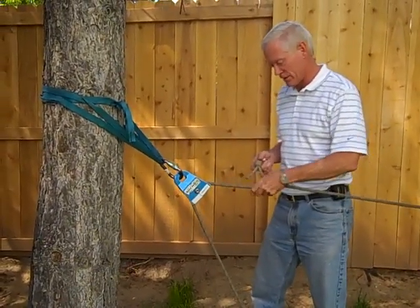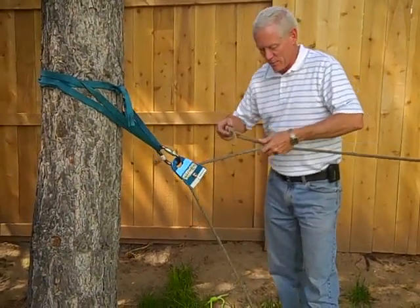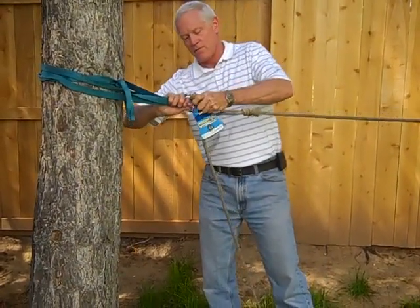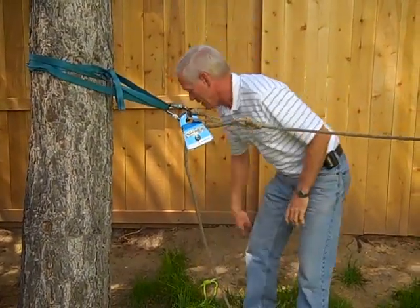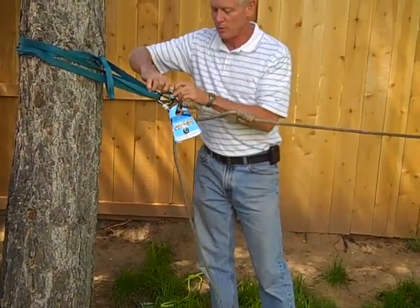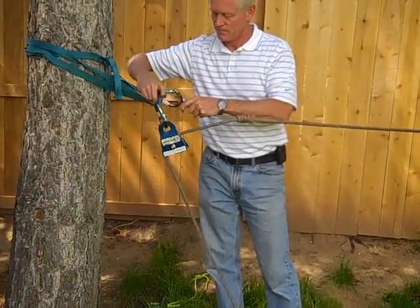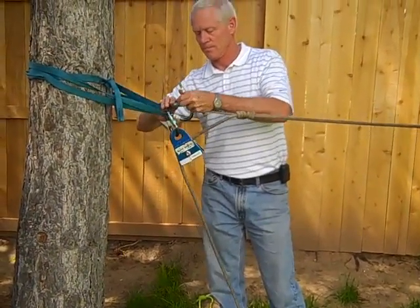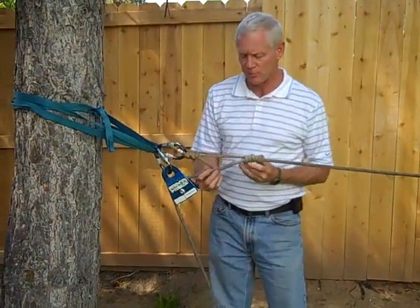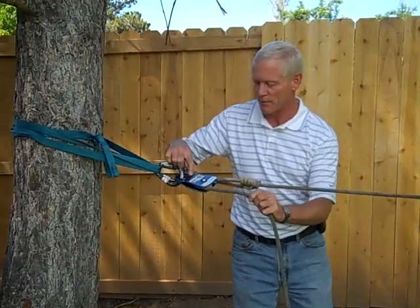Remember, we need two of these eventually to be able to back up the system if everything fails, so that we don't have to keep walking it back with the system. We can just put this right on here now. I'm going to put a separate carabiner to it so it's different than the pulley, so I'm just going to move it over one. So we have this prusik hitch that's capturing our rope as we take it in, and we have our first pulley.